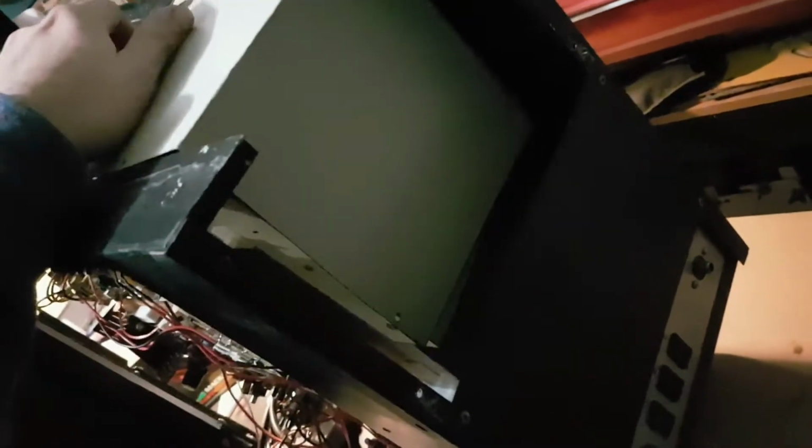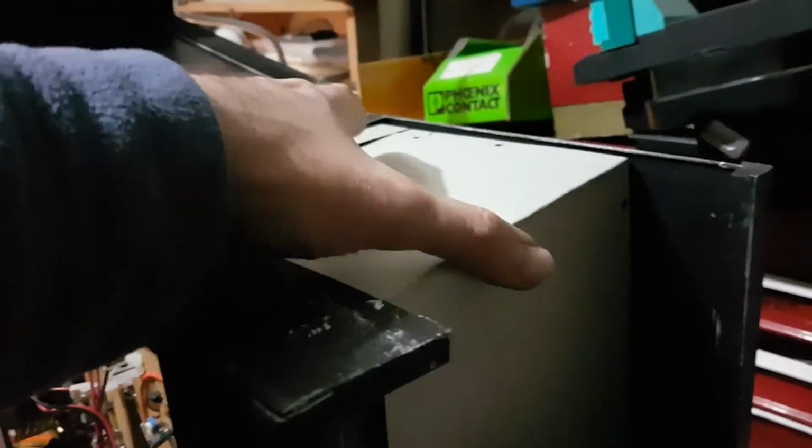Anyway, looking at the back of the camera, so when I put the tube in and take it out, I've got this cover on here. This is the wrong way around by the way. I've actually had to widen this area a bit so I can slip this inner hatch in and out. Alright, so it's sitting like so, pretend that it's bolted in. So when I want to remove the Iconoscope tube and put it back in, I just unscrew the inner hatch, take it off. I think I might have to widen it just a little more, but I'll see about that.